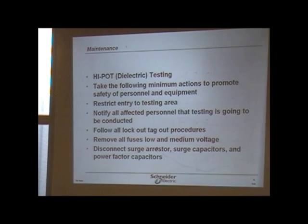Yes. Just for the sake of a one-line diagram: utility comes in to a transformer, ties into a switch, like a high voltage HVL that we're going to cover here a little bit, and that's exactly what this is, more or less. That in turn can feed a certain amount to a common point, and that's where we have those motor control centers that we were just talking about. Again, there's a disconnecting means on one end, and you're going to have a whole bunch of them. This one in turn feeds another line somewhere else, or feeds more than one. Let's say this goes to another HVL down over here, several HVLs.